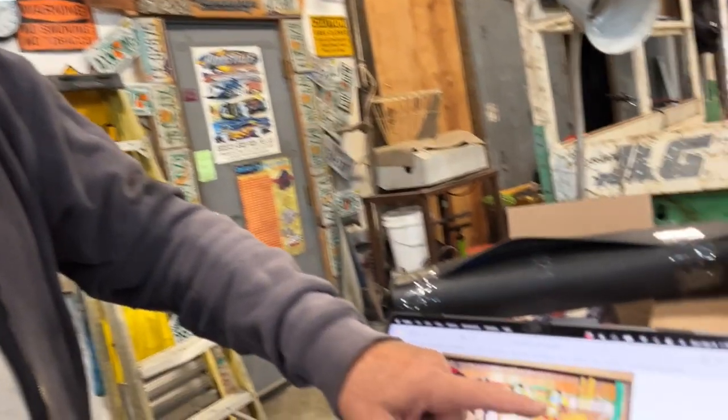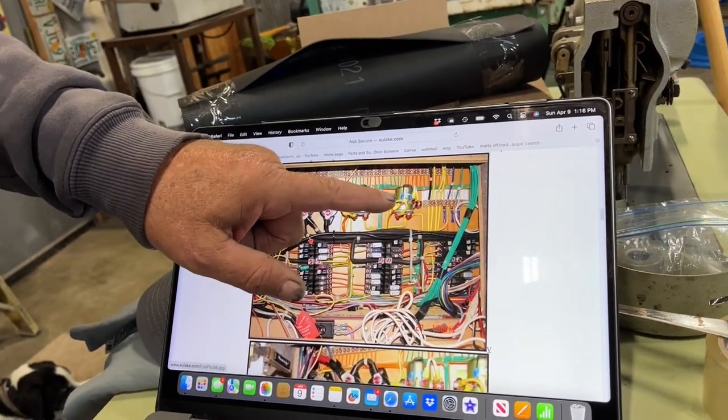So that was a year before — we did that in 2022. The wire was still tucked and hidden, but we knew a wire had to go there. We looked at the bus bar and sure enough, there was a drilled and tapped hole in the brass bus bar where a wire should have been. We dug around, found the wire, hooked it up, and that fixed it. It's always the ground, it seems like — but we chased our tail on that for a couple of days. It's amazing that those two big relays control the bay door locks.